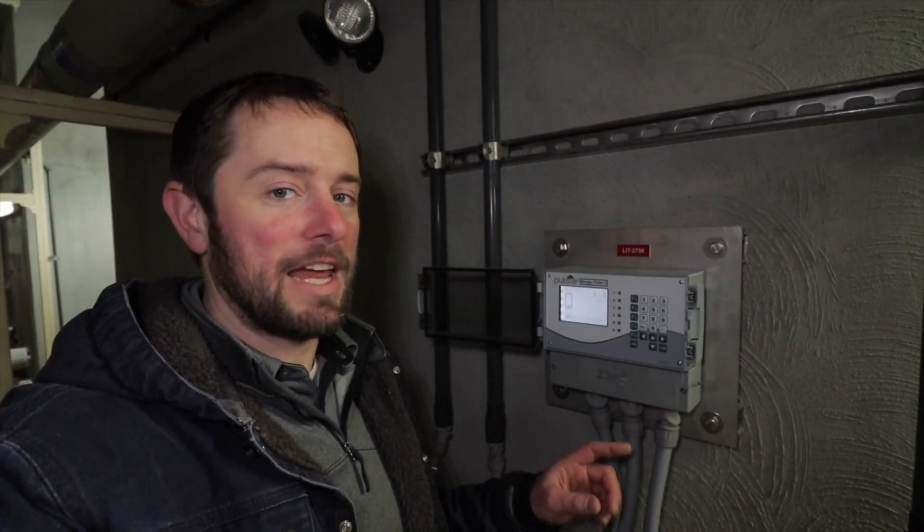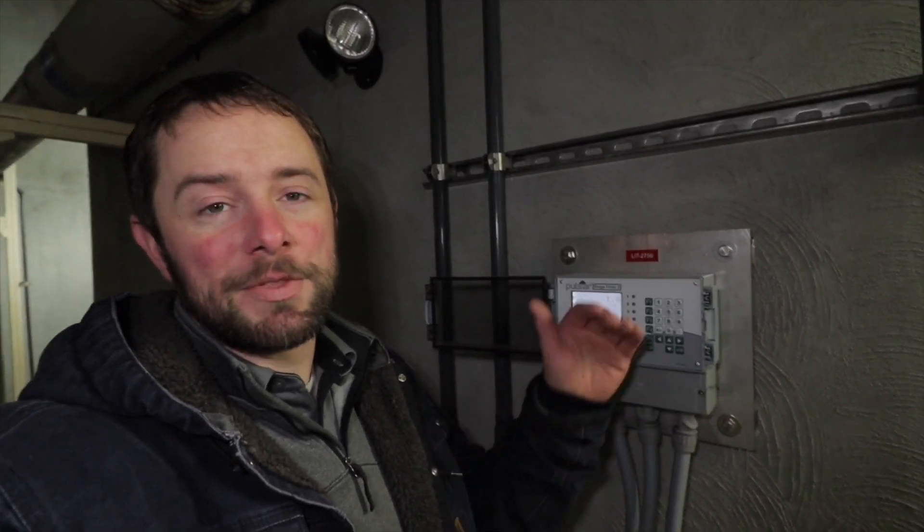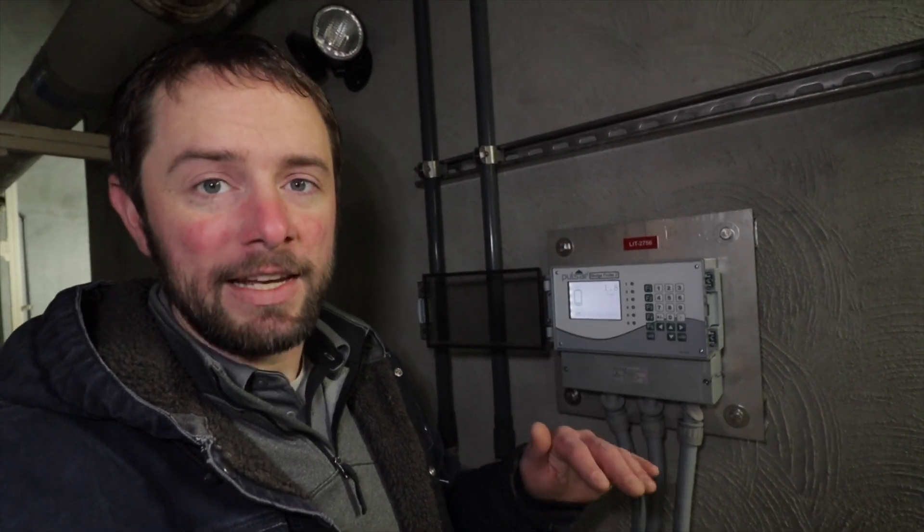While this rig is great for the core pole, it's really only half the story about these depth-of-blanket measurements. The other half at our plant is real-time indication from this Pulsar Sludge Finder 2. It's a lot like other ultrasonics you might have seen, but this one is in the water and it's programmed to see the difference between blanket and water.